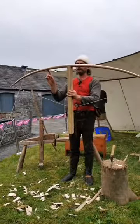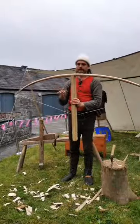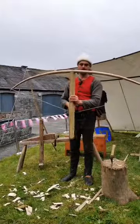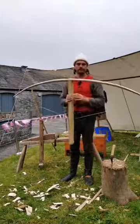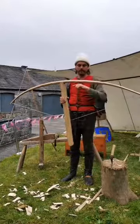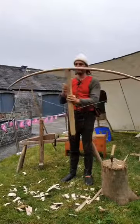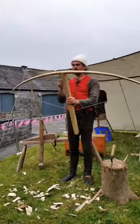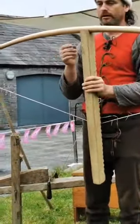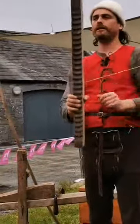The tiller is the main detail of longbow making — getting the correct tiller is critical. You've also got to remember it's a natural stave with its own shape, so there might be kinks in the wood when you take off the string. I think this section from the handle might need to be a bit more free to bend. Turned around now, you can see it kind of looks a bit like a crossbow — I wouldn't usually leave it on the tiller this long, it's just taking longer to explain.